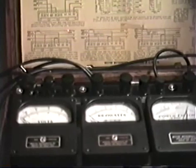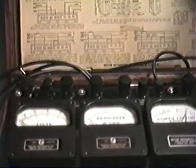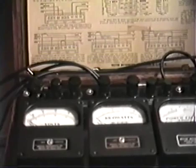Coming on back around now to finish the instruments, we see a bank of instruments here. We have first of all a voltmeter that reads the voltage of the output of the triode. Then we have a kilowatt meter that measures the actual power output of the vacuum triode. We take a look at the phase. You'll see that that's really single phase current and everything's in phase. Then the amperes being put out, or the current being put out into the load by the vacuum triode.